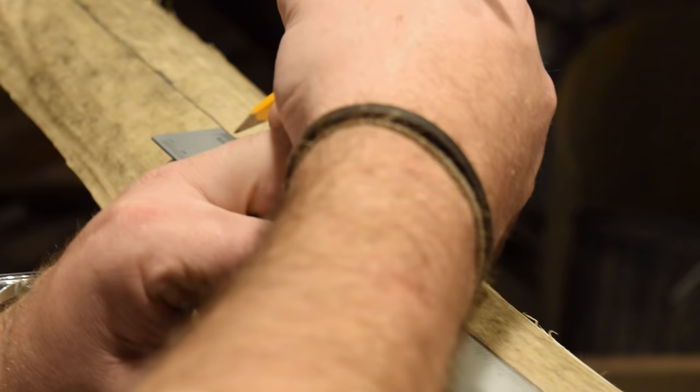Whoop, just made it. All right, so using a hatchet, you pretty much want to work straight down. It's good to have a stump because then you can cut all the way down to the end of your limb. Just watch your grain. You don't want to hit a piece of grain that wants to go in toward your limb, because if you hit too far, it might crack in and kind of split all the way in. So watch your grain. You might have to flip your bow up and down a little bit. You might have to work on the ground if you're working up in your handle material area. But otherwise, have a sharp hatchet, work straight up and down as much as possible and just remove material slowly.